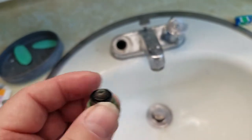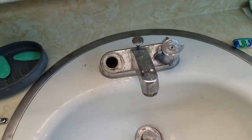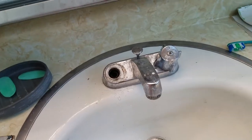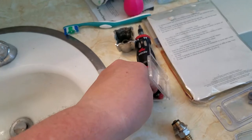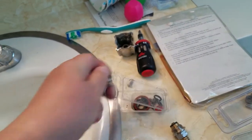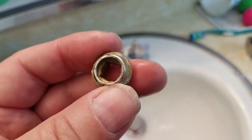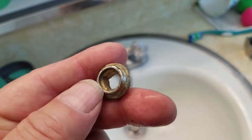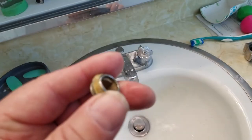Replacing the gasket is easy. Sometimes these little seats down here are hard to find at the hardware store, and actually you can reuse them. Now, there are two different types of seats. Let me show you one that goes to my shower — this is a shower or bathtub valve seat, and it's chrome plated. These are probably the best kind and they last the longest because chrome is so resistant.